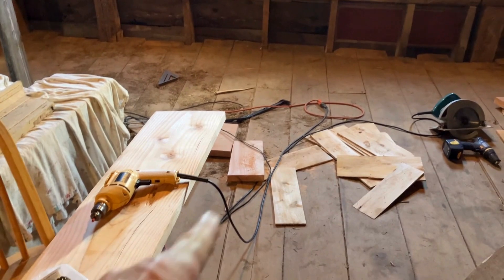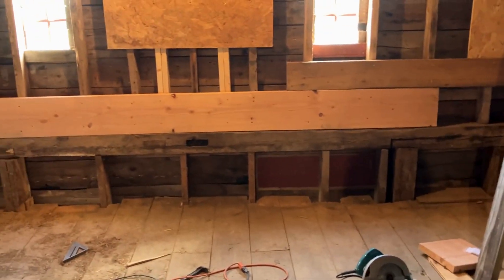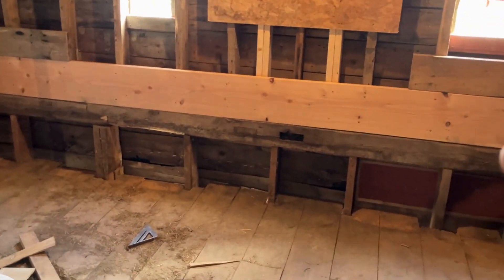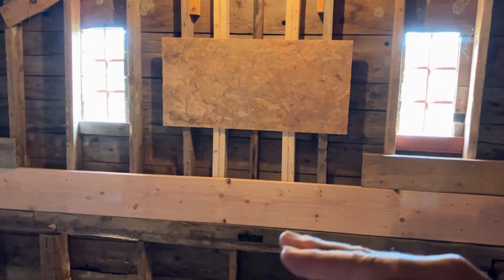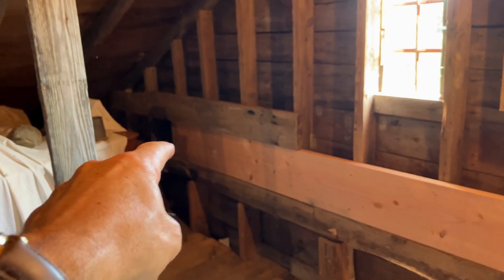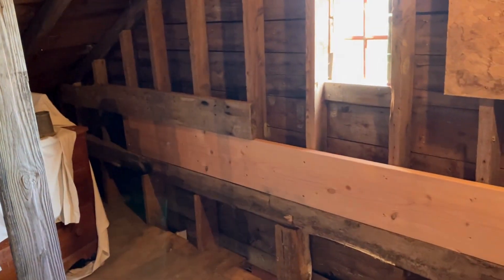Here's the other one right here ready to go, and nail it across the top of the beam — just temporary. I'm going to remove it later, but it's screwed — two on each stud all the way down — and that is going to stop this wall from sagging. It'll hold it in square. And then I added another hefty piece of lumber over there, again screwed with heavy duty screws, two on each stud.